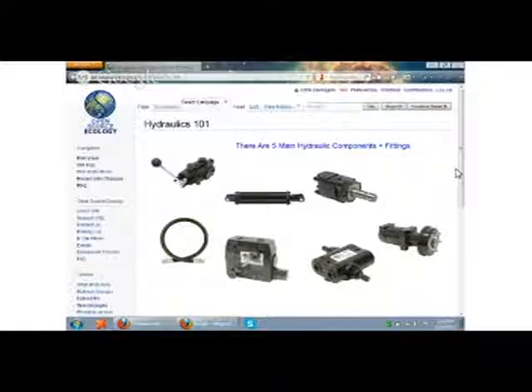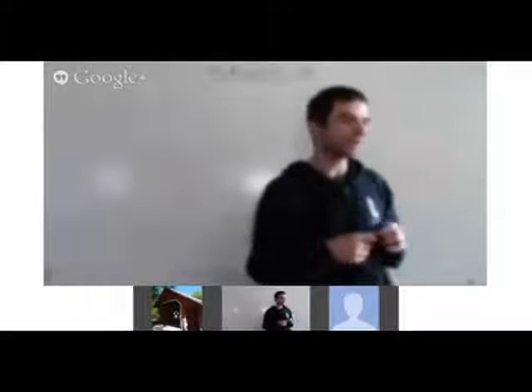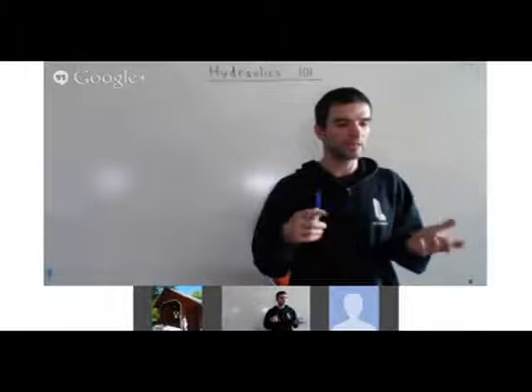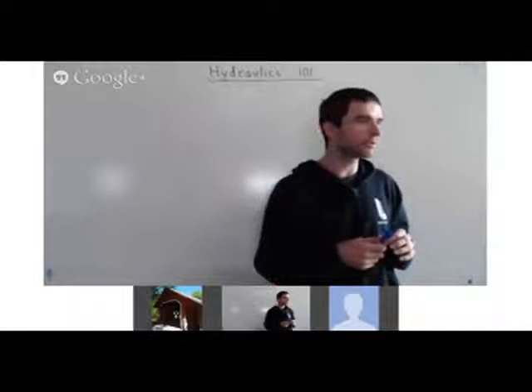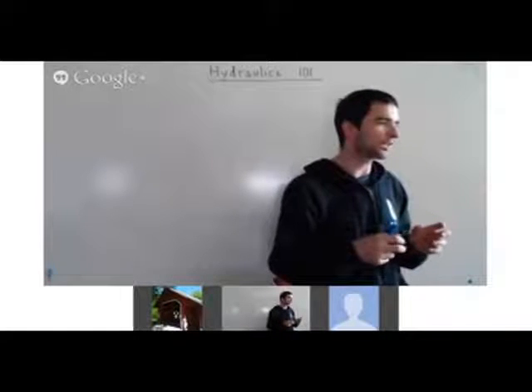The good thing about it is you have this big engine and then a tiny pump — literally like this big. This little thing, on our 27-horsepower power cubes, creates fluid at very high pressure, like 2,000 to 3,000 psi, that transfers the power to all the different wheels. This bypasses the need for a transmission because the transmission is done through hydraulics. These hoses are flexible, so you can attach any kind of active power component very flexibly instead of using things like transmissions and mechanical shafts.